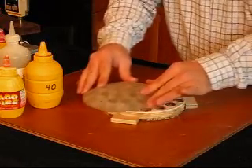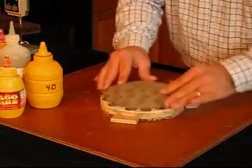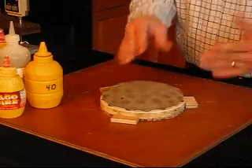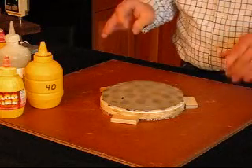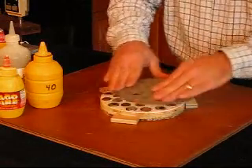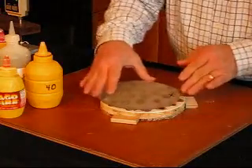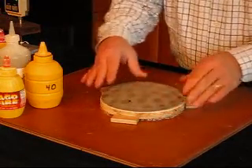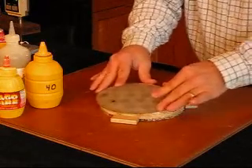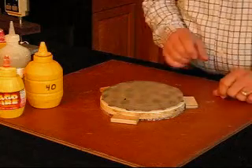You make the same strokes as before. You kind of have to play that by ear depending on how much you have to change it, but eventually you want to go back to rotating the part and keeping rotations so you don't develop any astigmatism. You also want to keep rotating the lap. This is a lot easier to do on a machine — when the bottom is spinning, you just hold it while it spins underneath and do the stretch like that.